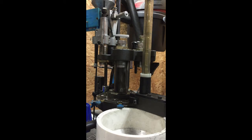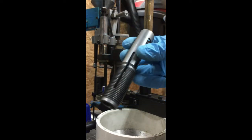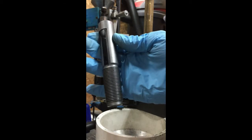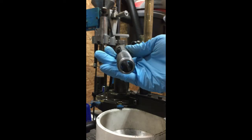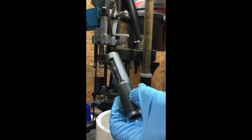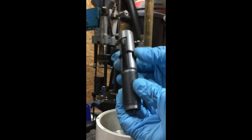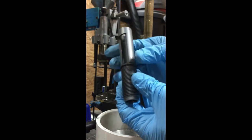Let's move on to getting the die set up. First thing you want to do is remove everything out of the die body. Just ignore the extra slot in ours — we made that while experimenting during kit development and it won't be in yours. Before you put the die body in, go ahead and take your o-ring and slide it down on top.